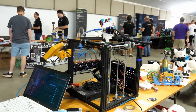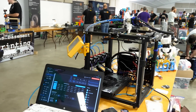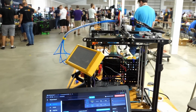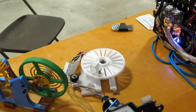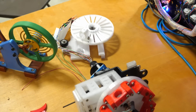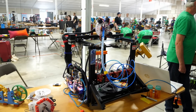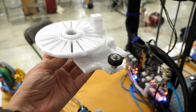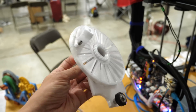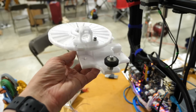Using individual hotends also allows you to work with very dissimilar materials because each tool can be set to a different temperature or even use custom hardware. The mounting disk is modular, which lets you install non-3D printing tools like pens, allowing quite a vast amount of applications. That said, I wouldn't add subtractive tools like a router, because the whole assembly is not crazy stiff and the combined weight of all the tools will cause problems during quick accelerations.